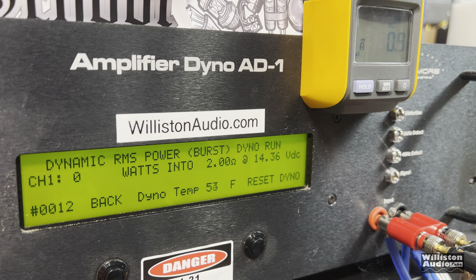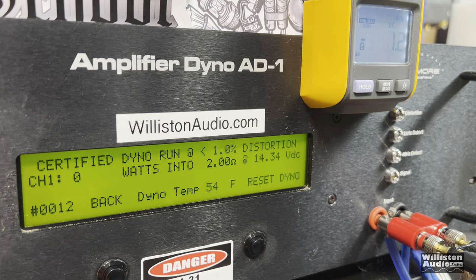This is a dumb test to try, especially for the 'does it bump though' segment, but let's try it anyway - 2 ohms mono, dynamic burst at 40 hertz. We got our 400 watts: 429 at 13.85 volts. Thump T3006 - not rated for 2-ohm mono loads. We're going to try 40 hertz certified, 2 ohms mono, 1% THD. Whoa, we got our 400 watts - 431 at 13.97.